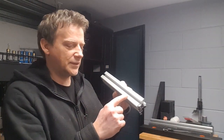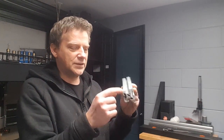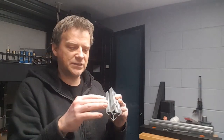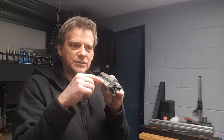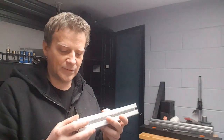Some of you will ask why I didn't mill the other way. I wanted to have the top edge straight without any zigzag on it. Also, because that's the profile, and if the mill goes over something so thin it vibrates, and if I would go straight this way it would go into resonance and the finish would be horrible. When going lengthwise, the pitch of vibrations is changing over the face but it's not amplified because it's constantly changing. So it's not perfectly smooth — you see some milling marks — but it's not big enough to actually start vibrating and damaging the whole thing.